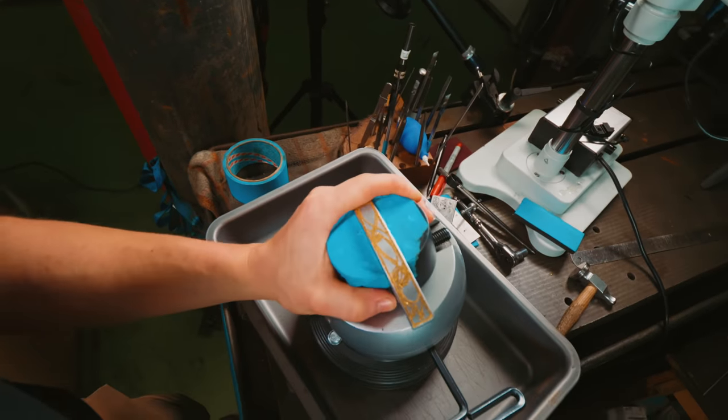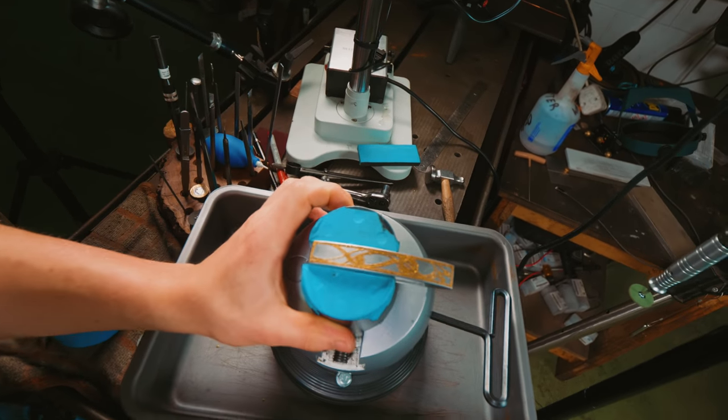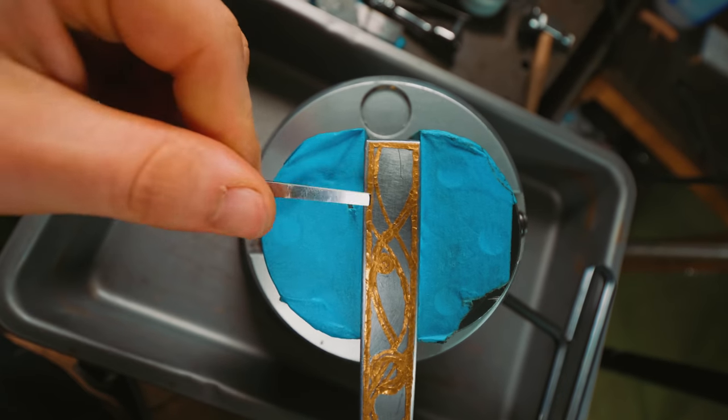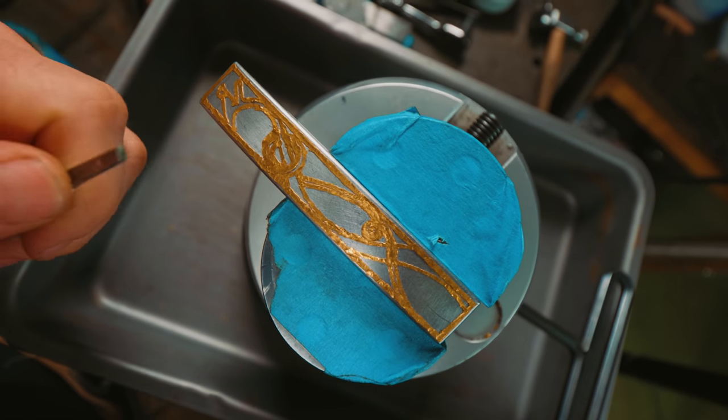And that was cool, because the first time I inlaid the gold on that first side of the upper guard, I'm sure it probably took me 4 hours to put it in, if not more. Now, 1 hour, all the gold is in, I'm feeling confident about it. Which means that now we're gonna take ourselves a little chisel here and we're gonna cut off the top layer of the gold before stoning it down flush, ready for background removal.